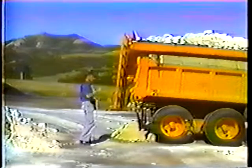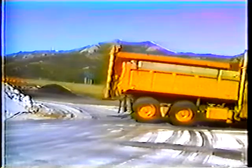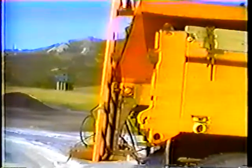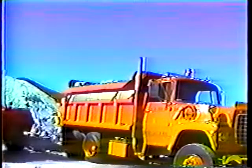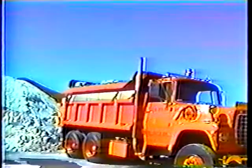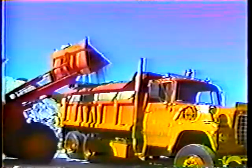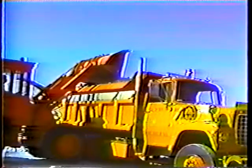The first thing to do is to get a load of salt, but be sure to leave enough room to work between the stockpile and the truck. It's important that the hydraulic oil is warm before calibrating the sander, so run the chain for a few minutes before you load the truck. You'll need at least a half load of salt, but it's even better to get a full load. Be sure to use salt — the entire procedure is based on the known weight of salt, and the weight of premix varies, so premix is unacceptable for calibration.